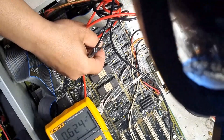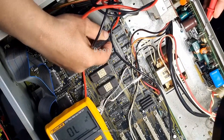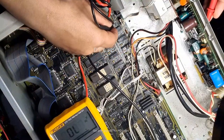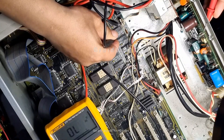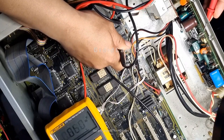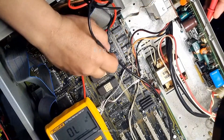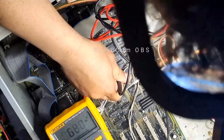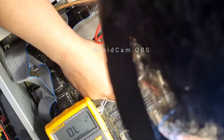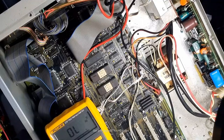All 0.6s and 0.5s — normal diode drops — but there's one there: short. So it could be a dodgy chip. I'm getting a lot of short pins coming up. There's a short there. I'm wondering, like what you guys are saying, maybe it was overpowered and some of these chips have got damaged. Short, short — look at that, two shorts on the same chip. Another short. So have a look at that, tell me what you think, comment down below, let me know what you reckon. You think these chips are a bit dodgy?